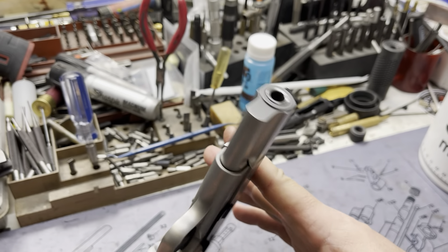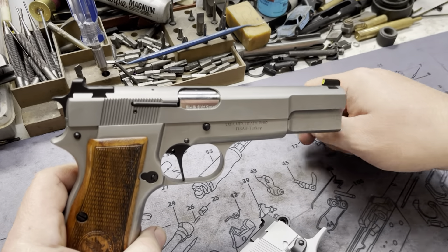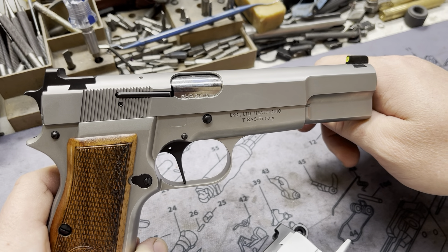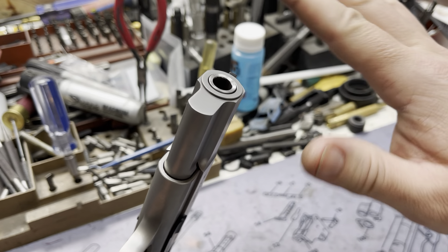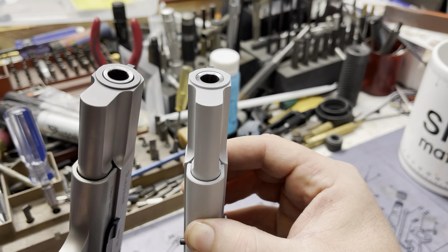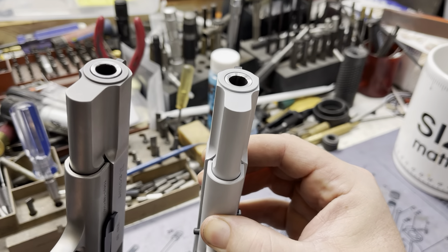Classic barrel profile. He did replace both pistols' barrels with the BH Spring Solutions barrels. These are the 1-in-10 twist — really nice barrels. Probably the newest barrel offering out of all the manufacturers, and they come with an 11-degree crown from the factory. The other one is crowned at 11 degrees by us, so a little more custom versus a little more factory looking.